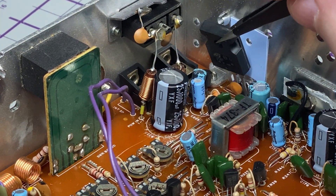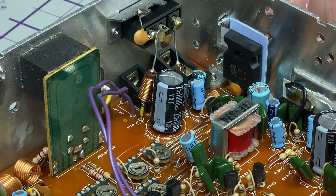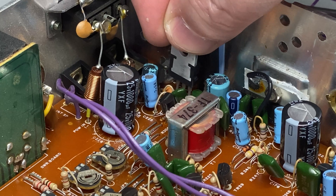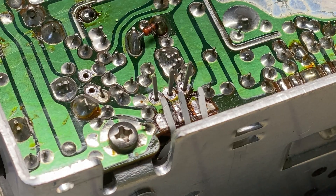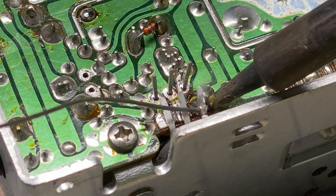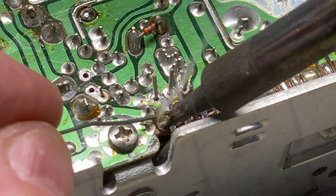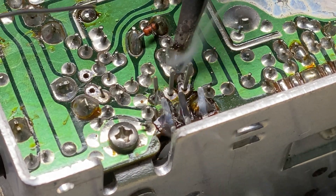We've put a nice new insulating sheet in there for our new regulator, which replaces the 2SA1012, and we'll put in the driver for that transistor — just like so — and then solder those into place. There we go, that's the main regulator soldered in. Now we will do its driver — very nice — and we'll snip off the excess.